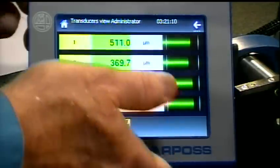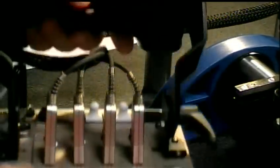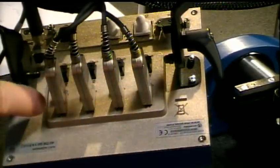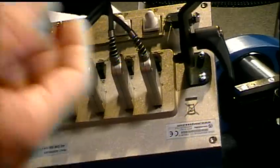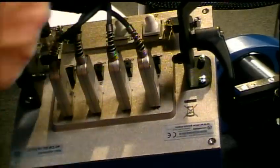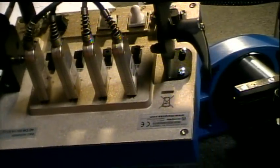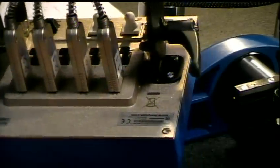Let's take a look at the back of the Nemo first. This Nemo is called the Nemo 8 — it happens to be an eight USB input gauge computer. We've got four inputs already used up, and there's another four inputs on the bottom, so eight USB inputs total. There's also a couple of Ethernet connectors so that you can send your data to a computer on your LAN, and there's also an RS-232 connector for outputting data serially, maybe to a laptop or another computer.